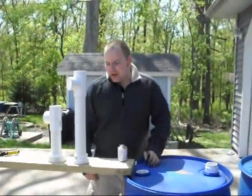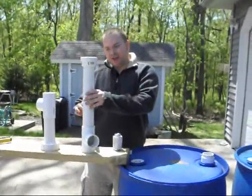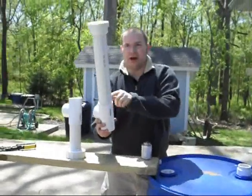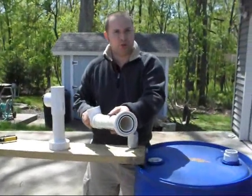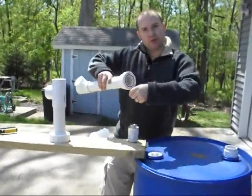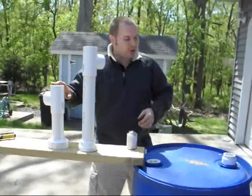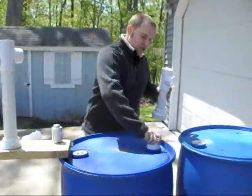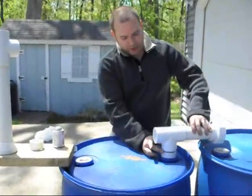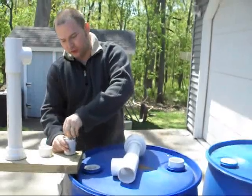Welcome back. We have finished the PVC cement on both sides here. I did one at a time as I twisted it in place. This allows the PVC cement to make a nice ring around each surface to make it impermeable to water. After I left it sit for five minutes, then I twirled this side with the PVC cement, put this side on, and let it sit for five minutes — and the same thing with this piece here. Now we're going to go ahead and attach this part to the little piece here and add it in. With this, it's very important that you have a very good foundation and base so that it's really squeezed together. That's why I waited to do this until last.